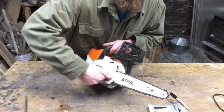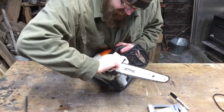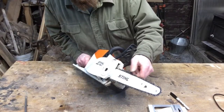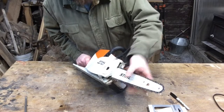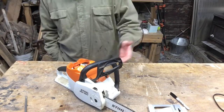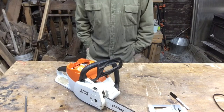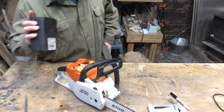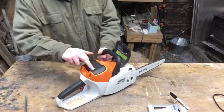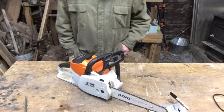What I want to do is grab this and if you were looking down on it, we're going clockwise. Crank this thing on good and tight. Pop that down. Check my tension again — that looks good to me. So this saw is now ready to cut. Your chain's good to go. You've got to make sure you've got bar oil in it, or you're just going to burn your chain out and you're going to need to sharpen it. This is good to go though. Pop your battery in there. Full bars — I just got done charging mine. And that's it.